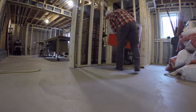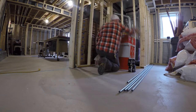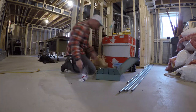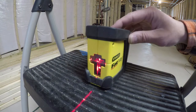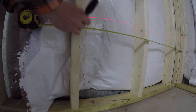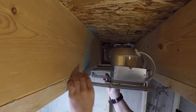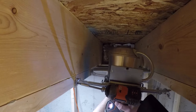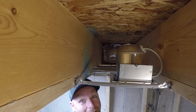For the lighting I went with eight 6-inch LED cans that are IC-rated. I'm going to be insulating the ceiling to knock down some of the noise from the kids running around upstairs, so I needed something that won't overheat easily — they are specifically made to be airtight and tested to be installed where the ceiling or joist space is insulated. I'm laying out my outlets 18 inches from the floor; since this is a basement it's not necessary, but I wanted to get a little higher off the floor. Installing the can lighting is super easy.